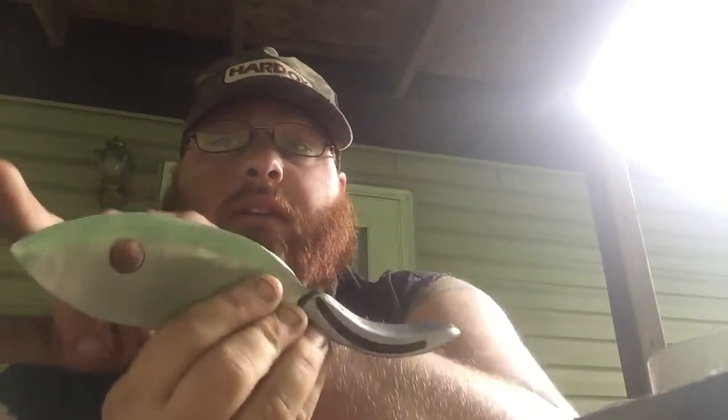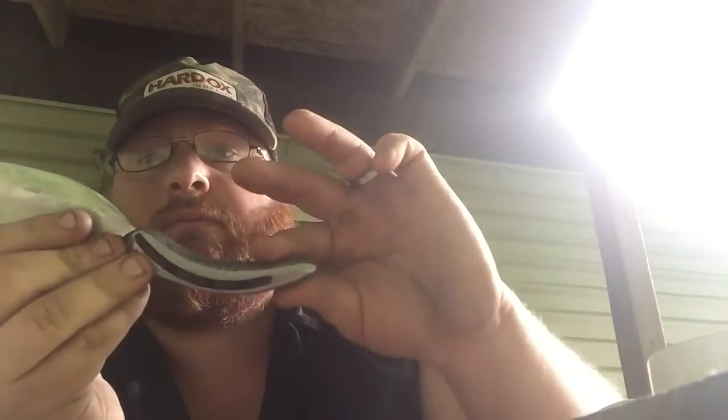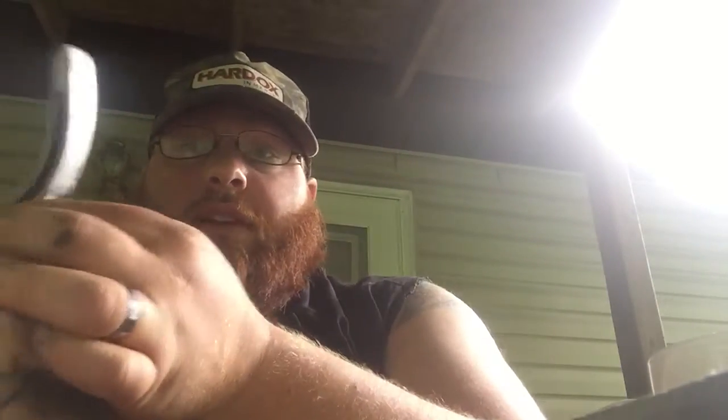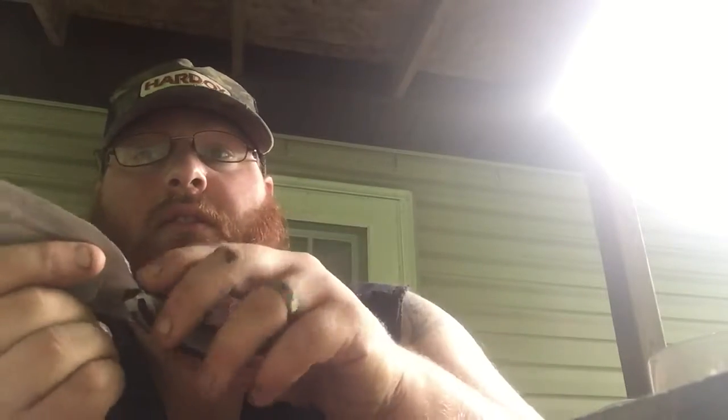Now the lawnmower blade goes clear back there, and it's all one piece of steel now. Well, because I filled this in, because this was actually wider on both sides and parts of it. The back here was actually sticking up a bit, and I just welded this all up around the original piece, and I ground it down till it was nice and smooth, sanded it, took a flap disc on a grinder and all that, cleaned up any sharp edges.